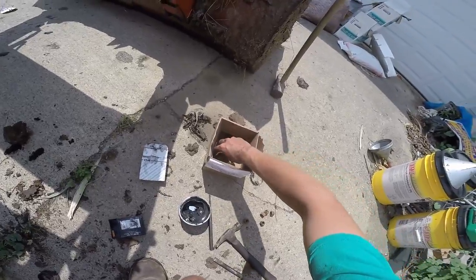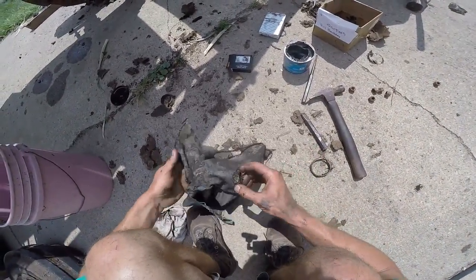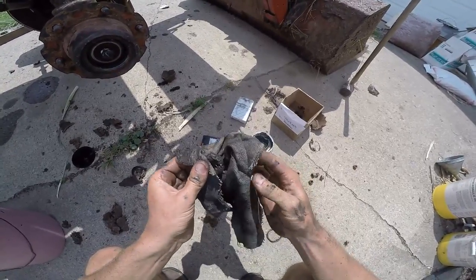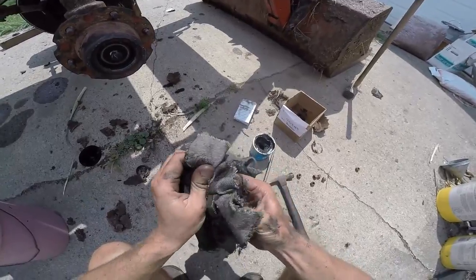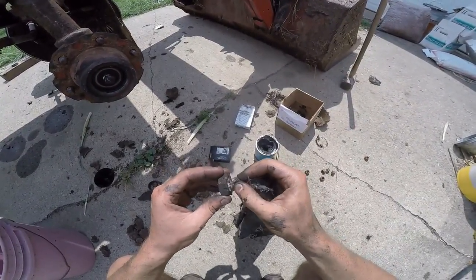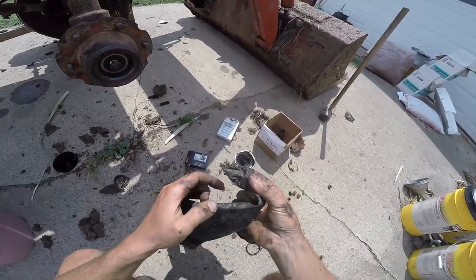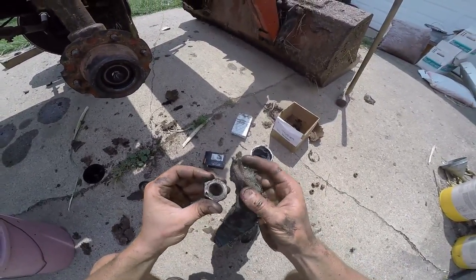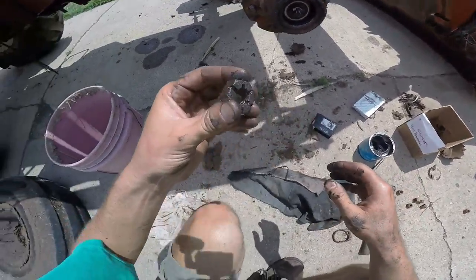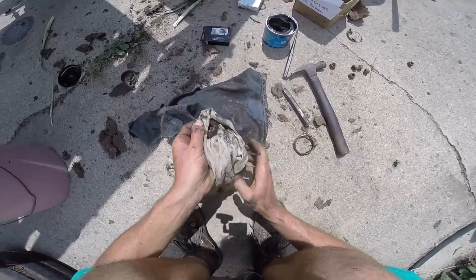Do we keep the wear points the same or turn it around? And my dirty nut. I must say, one project I hope I never have to do — we do wheel bearings rather frequently. When you've got so many wheels and wagons and the age of them, wheel bearings are going to happen. I never hope I have to do axle seals on any of these rear axles, because that seems like it could be a big project. You've got to take half the rear end apart, take the wheel off, and take the axle casting off to get to the seal to pull the axle out.